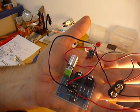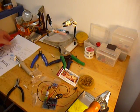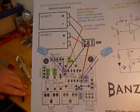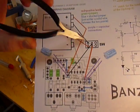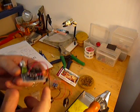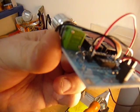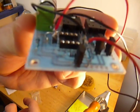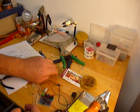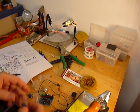The switch and battery cables have been soldered on. Just make sure you follow the diagram — just trace your wires. It can be confusing, but if you just take a deep breath and follow your traces, it's very straightforward. To solder your wires to those jumper pins, you just lay the wire right next to the pin and solder the wires on there. Now we're going to add the capacitors. The electrolytic capacitors are polar — they have polarity — so we've got to make sure we pay attention to that.